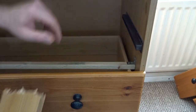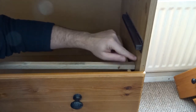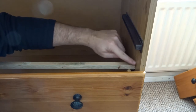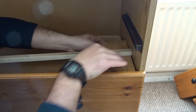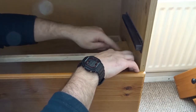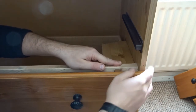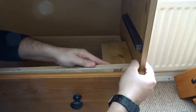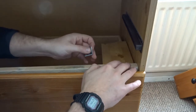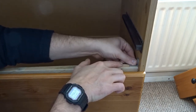What I'm going to do now is take a piece of scrap wood and I've made a mark to show where the drawer above ends, so I've got clearance and nothing is moving across that area. I'm going to use that scrap wood as a spacer to lift the brace equally off the drawer below, then work out where I want it — as close to the front as I can get it — and just check the clearance.